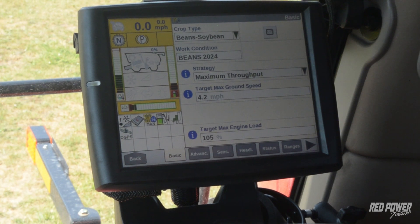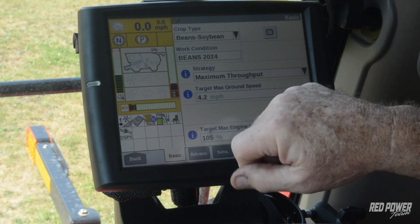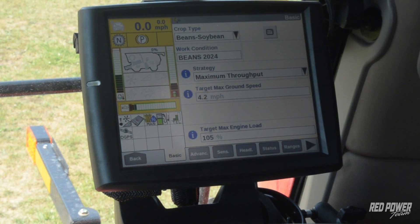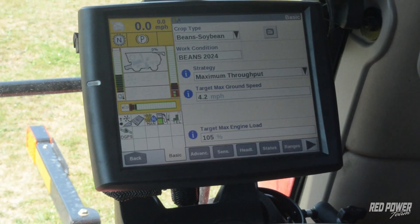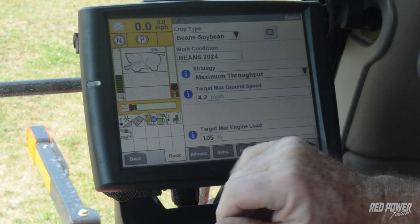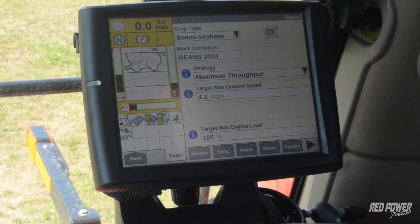The other question is: what happens when I'm trying to dump on the go? It will lock a speed in. If you hit the unloader engage — let's say in our scenario we're set at 4.2 and we're traveling at 4 mph when you get ready to unload — it'll lock in at 4 and try to maintain that. I don't particularly recommend that. What I've trained my customers to do is: when you get ready to dump on the go, bump your handle a little bit. It'll beep, kick out of feed rate, and this will turn gray versus black. You're back in control with your handle when dumping on the go. If you need to chase the cart or the cart's getting ahead of you, you can zip back and forth. Once done dumping, just reach up and hit the feed rate button — it'll engage and go again. I feel that's the safest way when dealing with a cart.